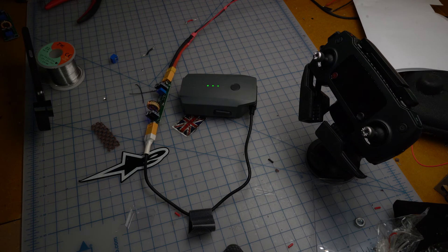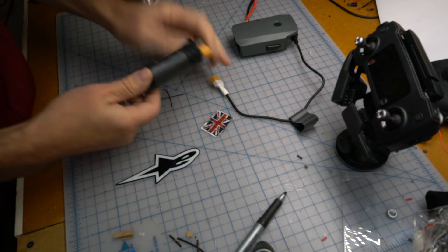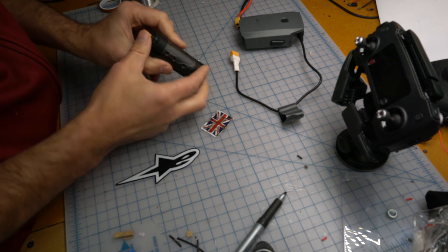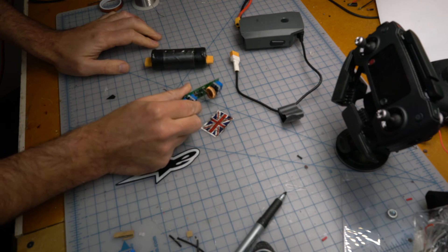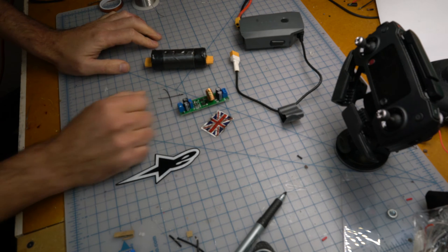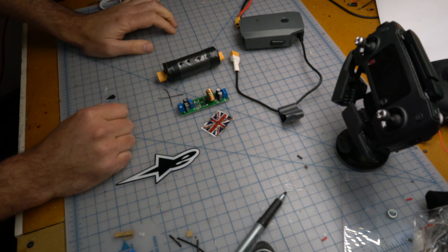It's probably two-thirds as fast as the wall charger, so it is a bit slower. But if you're just going to plug it in when you're driving from destination to destination and you've got like an hour and a half to two hours, you'll be fine. Here's the finished thing - I just stuck it in some tube, put some ends on it. Here are the XT60s. Basically we've gone from a $6 or $7 converter to this finished thing.